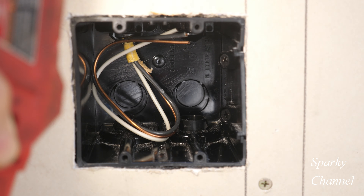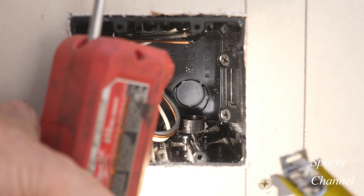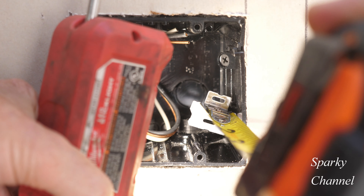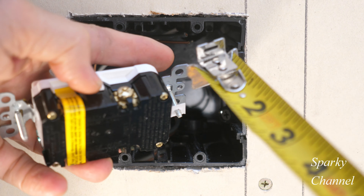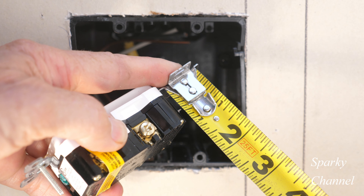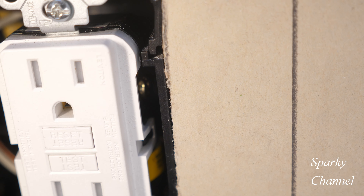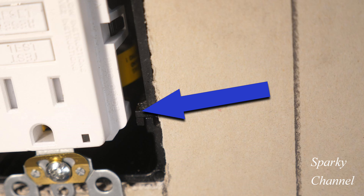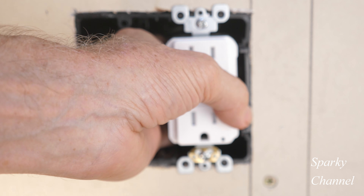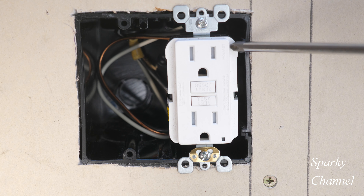I have a GFCI right here and I'm going to see if it goes in. Let's measure up. Here's where the screw protector is — that's one inch exactly to the edge. Both of them are one inch. If you measure your GFCI, that's one inch exactly. So let's give it a try. You see there's a space of about a sixteenth of an inch between the GFCI and the nubs. The GFCI is not hitting the protrusion that protects the screws, but it's awfully close.